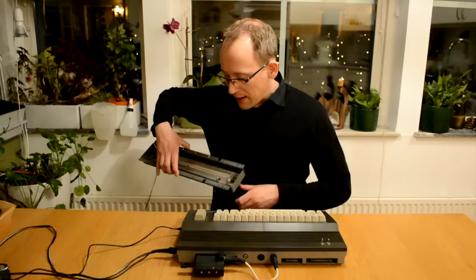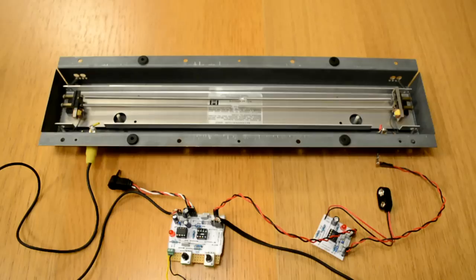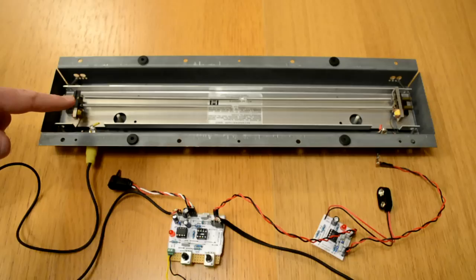I didn't have a cathedral at home, but I did have this spring reverb tank. So I built an interface for connecting the spring reverb to a Commodore 64. First, the raw 8-bit sound is converted to an electric current. The current flows through a coil here to create a changing magnetic field that yanks a pair of magnets sideways ever so slightly in proportion to the sound wave.